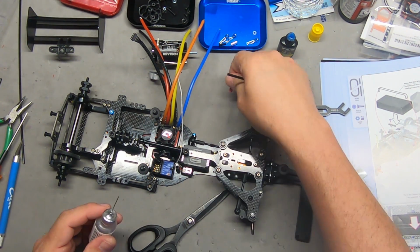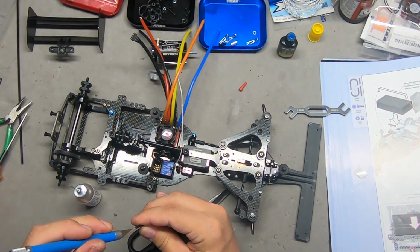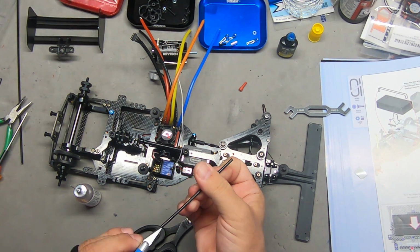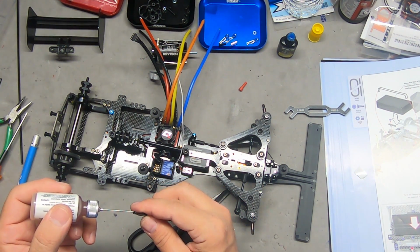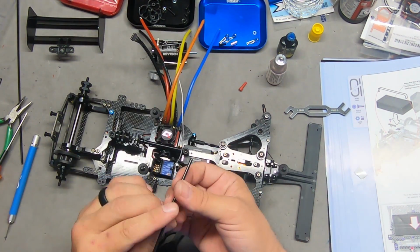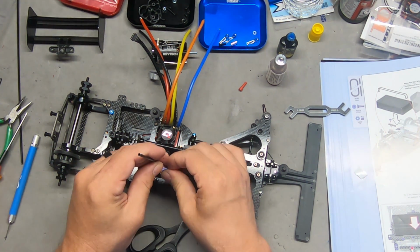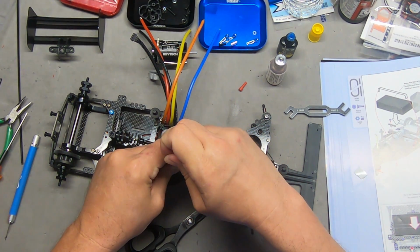Sometimes the antenna doesn't want to go through the tube. Number one, make sure that the aperture is loose enough at both ends. And then try just a drop or two of bearing oil. Very light, thin oil, not a grease or anything. And that will help slide that antenna right on in.